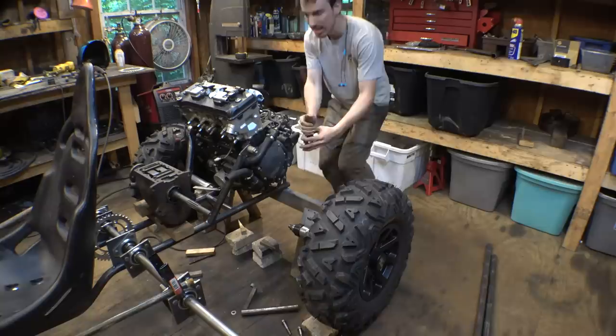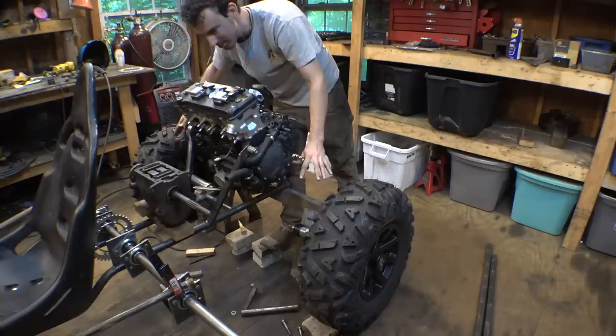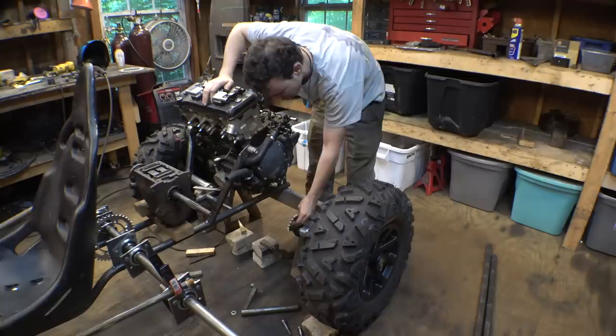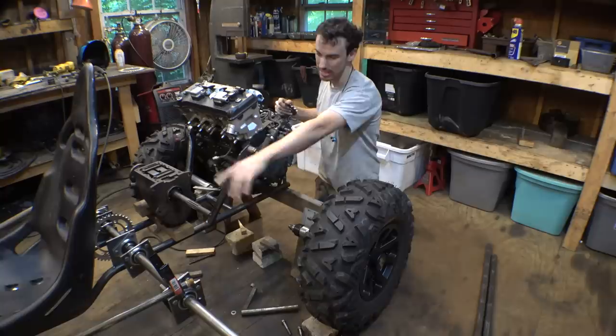There's gonna be another sprocket on the transmission that goes to the 1¼-inch axle. That axle connects the trailing arms to the rest of the frame. There's gonna be more sprockets going from the axle to the sprockets on the hub on both tires, and that is going to run both tires. So there's gonna be chains going from here to the transmission, to the axle, then back to the tires. It's a little bit complicated.